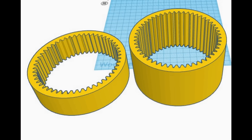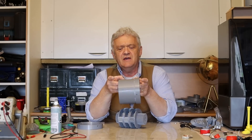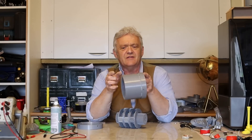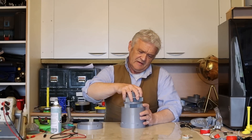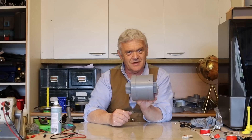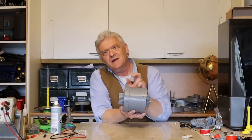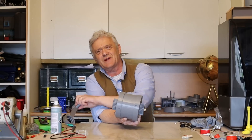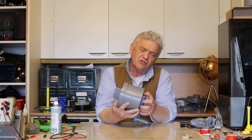Now if you notice, this main body is made of two parts: there's a long section that's about 62mm and a short section which is 35mm, and that's so you can stack them up. If you have only the long section it'll take two planets; add the extra short section and it'll take three; add another small section and you can keep on building it up — you can just nest this as much as you want. If we put that back inside here, and there's another cap you print off to go on there, we have our universal planet gear system. If I turn this one, this will turn slowly but with lots and lots of torque. If I turn this one, this will turn quickly but it needs a lot of torque here to drive it. The handle will fit on either side.